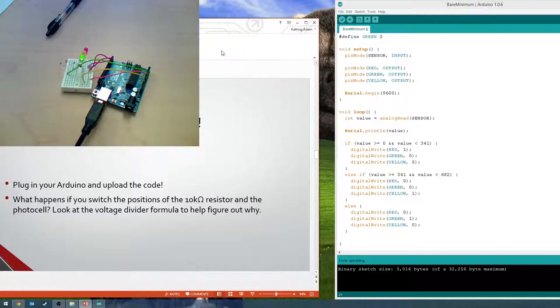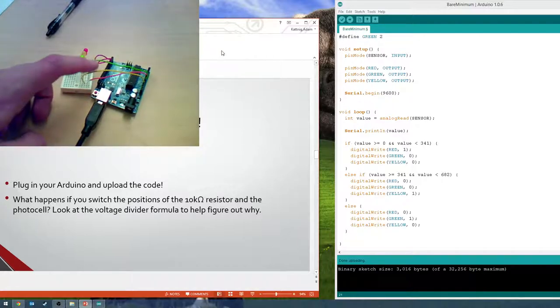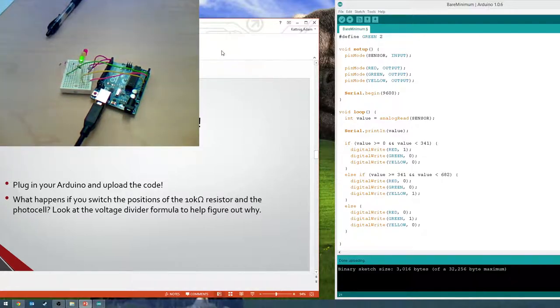Yeah, so what happens is, if you look at your thing, you have like a squiggle, right? On the other side you have another squiggle. You look something kind of like that. This is connected to one side, this is connected to another side. And this material in between, it's what's known as a semiconductor. So it kind of conducts electricity, it kind of doesn't. And with these, there's a piece of glass on top. If you look at it from the top, here's the edge of one side, here's the edge of the other side, and this conducts electricity, but not very well. That's because it doesn't have a lot of extra free electrons. So if you think about gold or copper, there's lots of extra electrons to give up, and so electricity flies through really easy, and it's great.